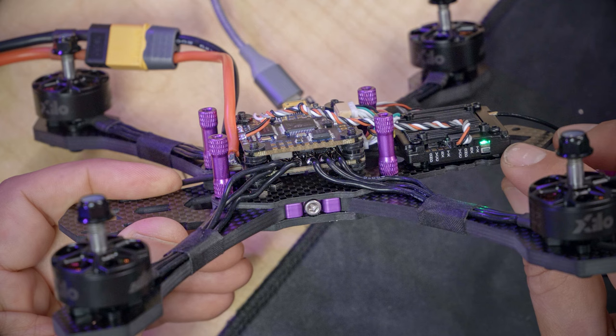I want you to take a look at this right here. Do you see the no SD card, 14.6 gig, down here at the bottom, channel 6. These OSD elements here are part of the Walksnail system, and the Walksnail goggles are drawing them and telling you about the Walksnail system, like how much space there is on the SD card in the goggles. These OSD elements here, like RSSI, DBM, and so forth, that is actually coming from the flight controller. And you probably don't have those, because the only reason these are here is because I used the same flight controller to set up the DJI video transmitter for the previous video. So hold on. I just didn't want them to disappear suddenly without you knowing why.